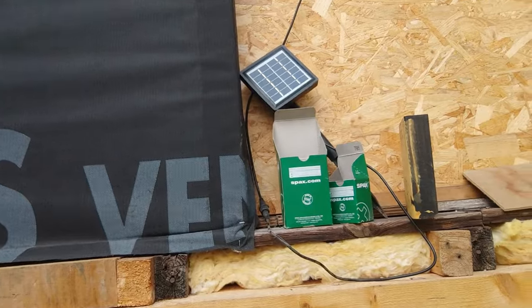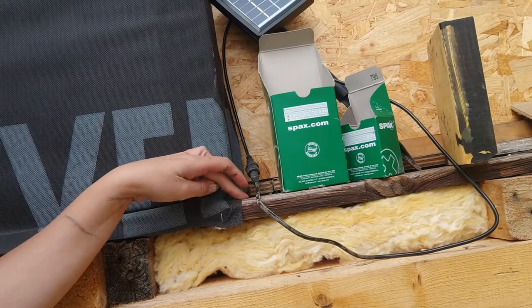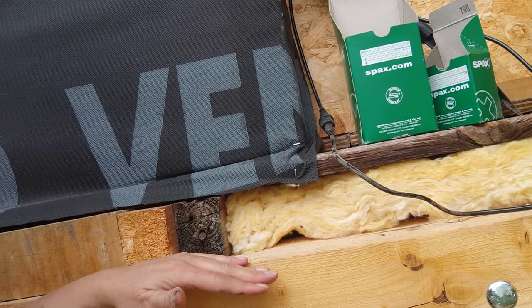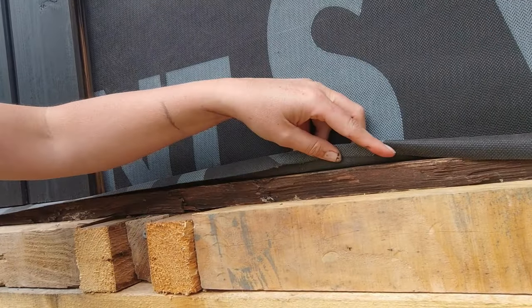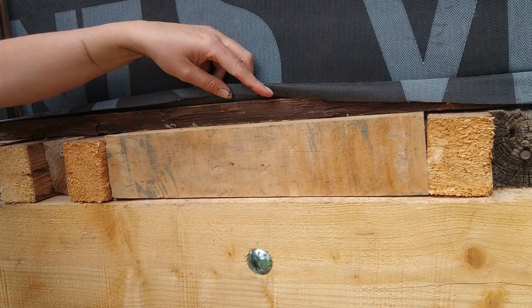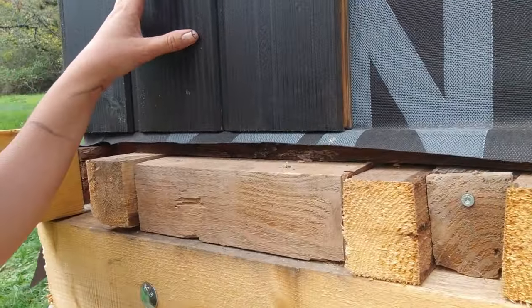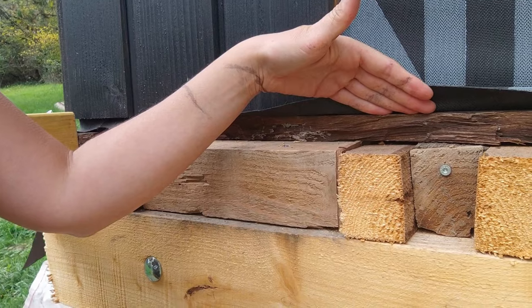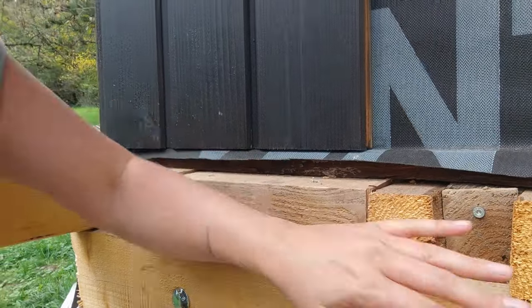Prime example is this very complicated situation that we're left with at the junction between the old house structure and the terrace, which is going to come on here. So I'm basically making my way along and doing a very, very dull job, which is cutting down some bits of old posts, filling them in the gap, which thankfully is the same height as this. Where necessary, mouse proofing and screwing in. And after, I think I'm going to have to find some kind of waterproof juncture between this and this, which I haven't yet found. I've been looking on the internet, but I haven't found anything yet.